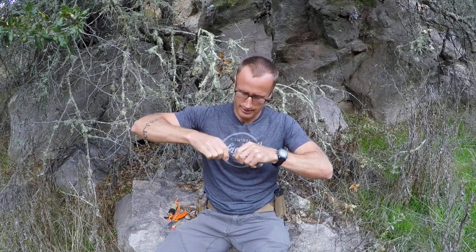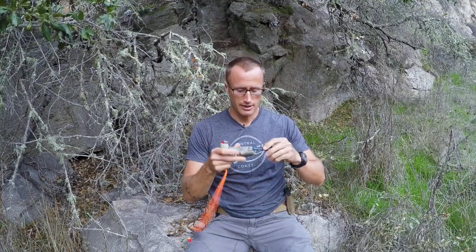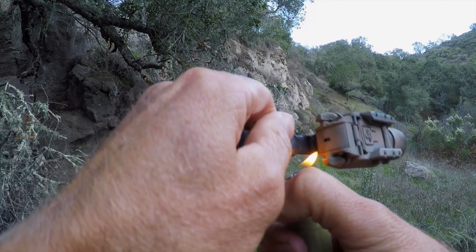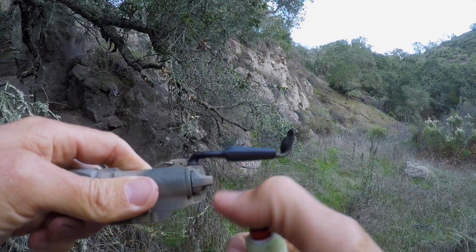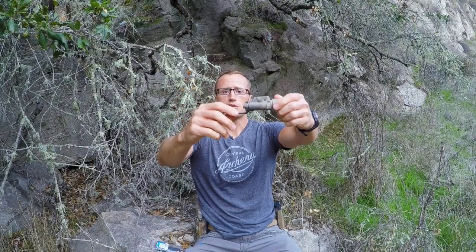Now that I have this piece I'm gonna go ahead and just slide it over — it takes a little bit of finesse but you essentially just work it over that switch and push it all the way back. Once I've got the heat shrink on here I want to push it forward and keep tension on it when I apply heat, because I want it to actually shrink down around this. Take my lighter, push that forward — don't get this too close or you'll burn it — get some heat going, get this section shrunk down, smooth it out, then hit this last section. And there we are — we have our second piece of heat shrink.